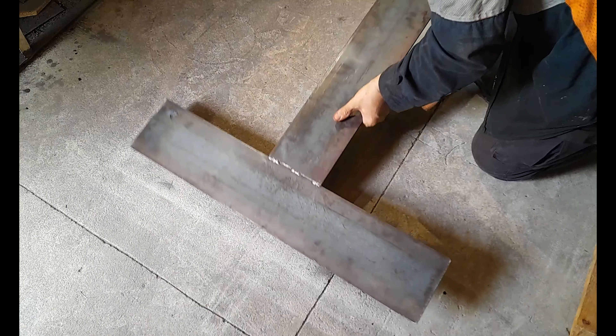I'm cutting it down to 150 millimeters in length. Then place your 20 by 20 millimeter box — that you've drilled your 8 millimeter holes into — 30 millimeters in from the edge of your piece of merbau. With a pencil, mark through your 8 millimeter holes onto the merbau. Make sure your box is straight on that merbau, because if you mark your holes crooked, when you put your bracket on it will be sitting crooked on your 20 by 20 when it gets welded into the bottom plate.